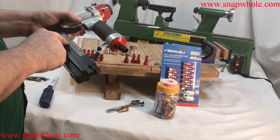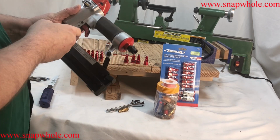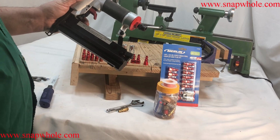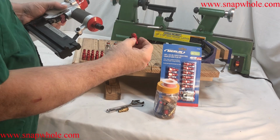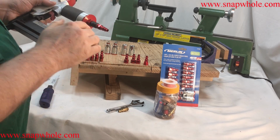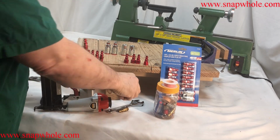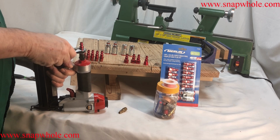It was a replacement for the 2-in-1 nailer stapler, but it came with an adjustment wheel, so you didn't have to go to your tank and adjust the pressure all the time, which is really convenient if your compressor's out back. So I'm going to take a male and screw it on there, and with that Loctite or Teflon tape that's on it, you're going to have to use the wrench almost immediately to get past that.